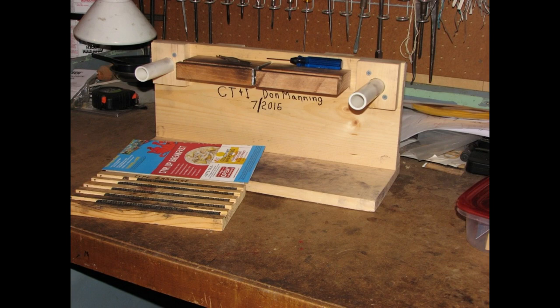The idea being that as you assemble one slug at a time with a back bar, clamp bar, and two screws, we have to produce the slugs really touching each other or the band becomes too long. Cleanliness, again, is critical. The slugs have to be washed and perfectly clean as you start this process. Otherwise, the band is too long. So this is the fixture that's used for assembling those slugs onto the actual band that we just produced on the mandrel.